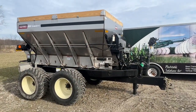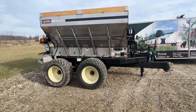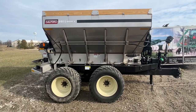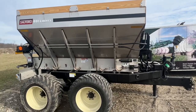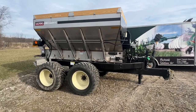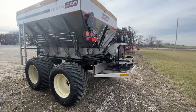The Liberty is our combination spreader, and it's very popular for that reason. If a guy wants to take control of the spreading on his farm, he's going to want to do it with both his lime and fertilizer. This is our 10-foot hopper, so you can do 10 ton of lime or somewhere around 7 ton of fertilizer in this hopper.